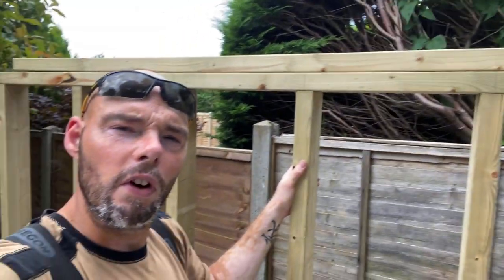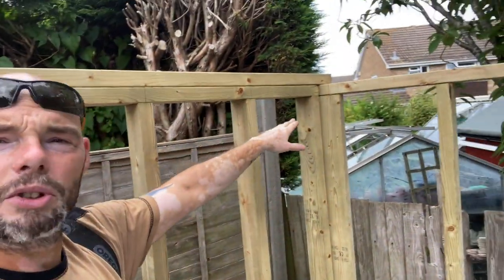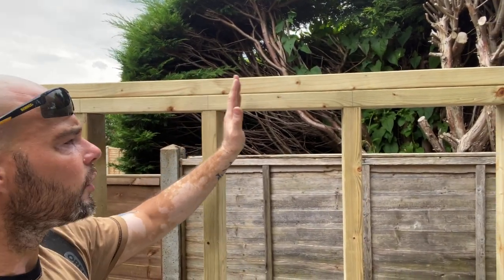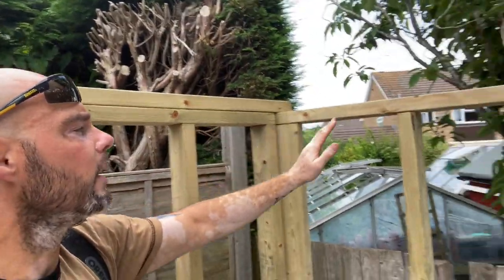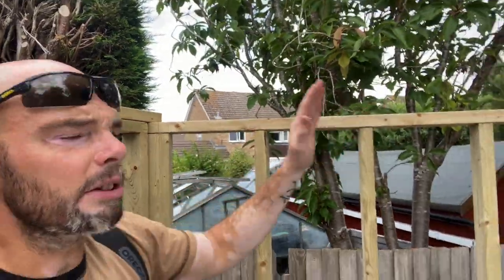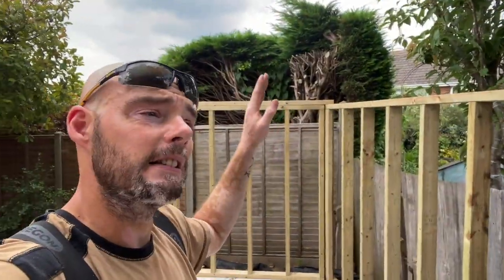Again, more important for stuff where you've got extra stories on top, but it's just good practice, you know? So what it does is it pins these two walls together so they can never separate. It gives you extra strength should your roof joist not quite fit exactly where they should be going, or your 400 centers. I always try to get them running off the centers, 400. But sometimes it doesn't quite work like that. So that's just what that does basically. It gives you extra strength and it helps to pin the walls together. Absolutely spot on. So that's what they're going on.